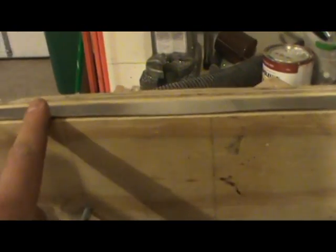You can see it's laying quite flat along the bottom edge with very little gap between flutes on this long straight edge. There's a little bit of waviness, but there's really nothing you can do about that on a hand-formed part — a lot of that comes from initially forming the flange, which stretches the metal slightly. If absolutely necessary you could put a fourth crimp in, but I don't think we need to. Once I pull it off I can just straighten that by hand and tease it a little bit. Next I'll form the front flange and the rear flange, then flip it over and do the top flange.